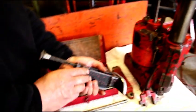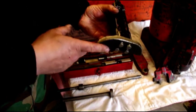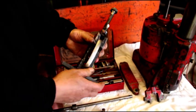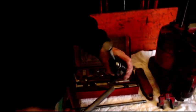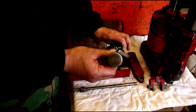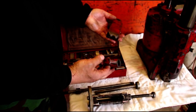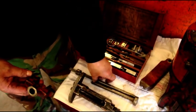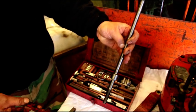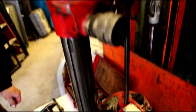This is our holder — this is going to go down underneath and we'll hook onto this. There's a little foot here that expands out a little bit into the cylinder wall. This little tool will help you reach down in there and adjust that in and out. You've also got these two pieces which are part of the clamping mechanism, and that's your main tightening bar — it's easier to show when I hook it up to the block.